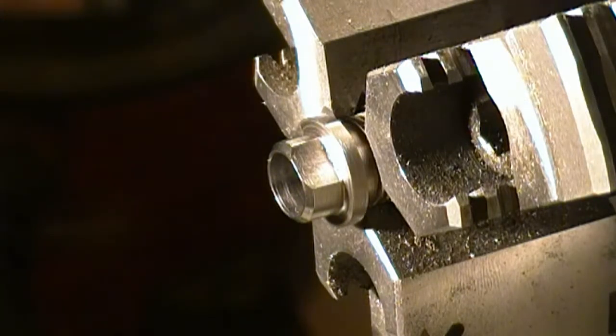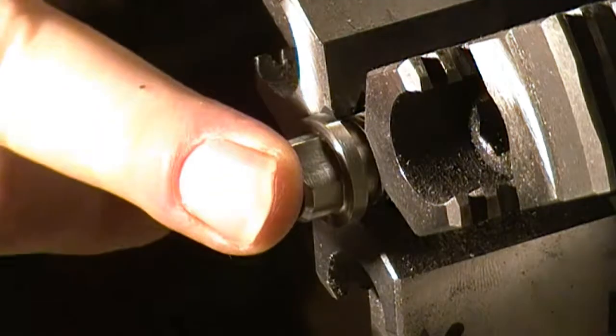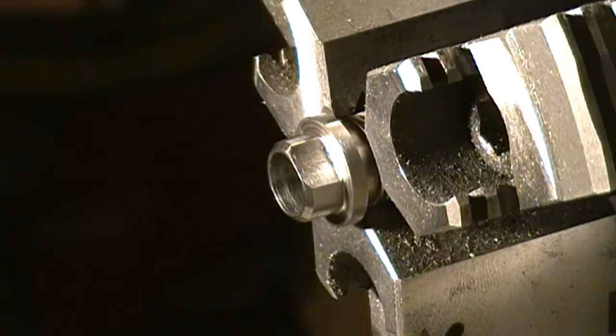I did nominal measurement on the breech plug itself and the 209 pocket was right around 0.240. I took a piece of 38 special brass — standard Remington Peters 38 special nickel brass — and after sizing it measured out at .376. That's three-eighths of an inch plus a thousandth: 375 plus a thousand is 376 thousandths. I thought, hey, I've got a reamer that'll fit that — let's give this a shot.